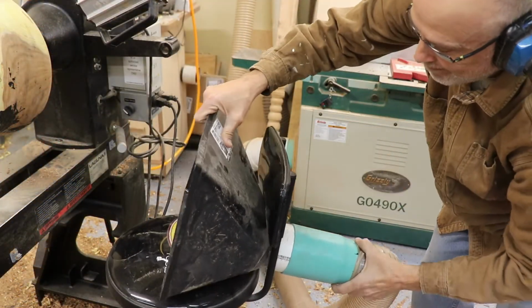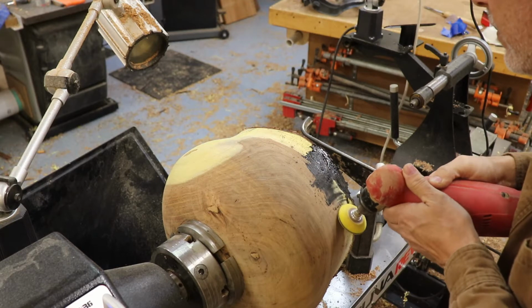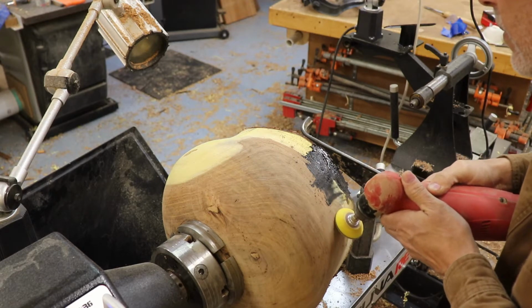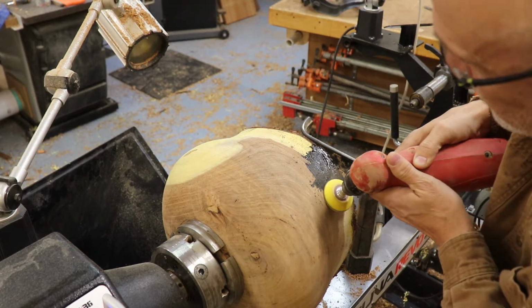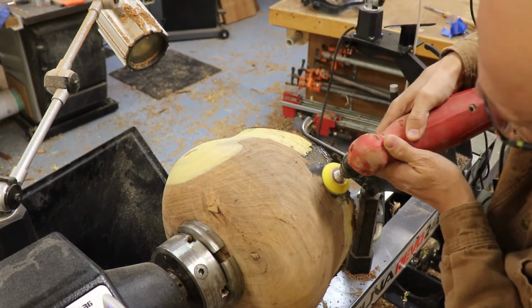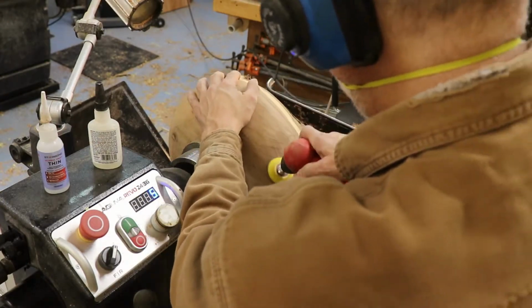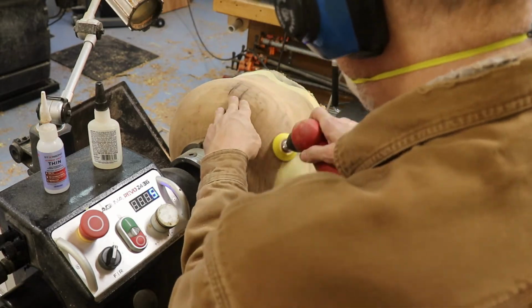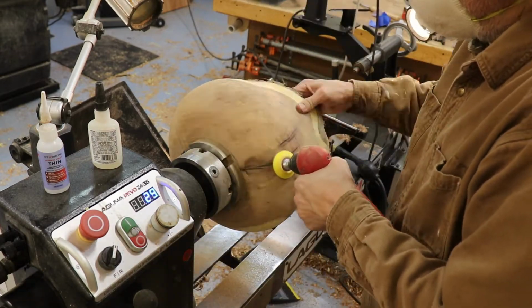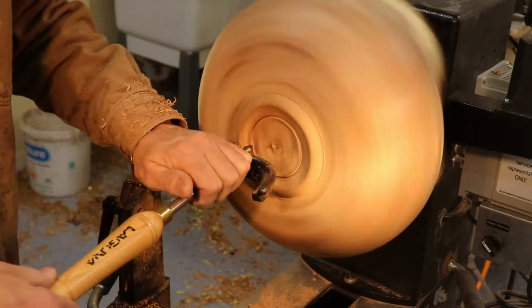And here's my handy dandy fancy dust collection mount kit using my chair, and then sanding using an angled sanding tool, and that really is a good ergonomic way to sand this. And I actually used a 40 grit on this because it was so tough sanding. That made short work of sanding out the resin and also the tool marks that were left behind.